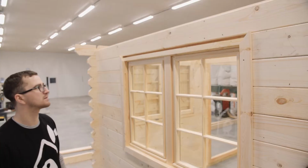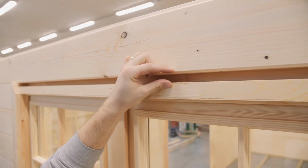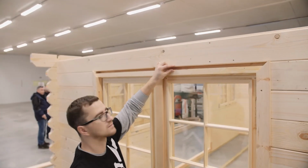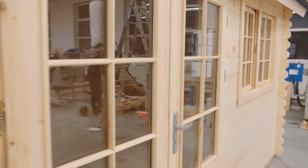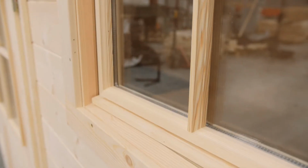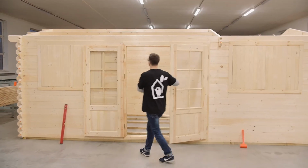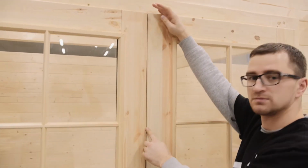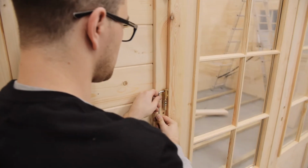The space between the door and upper wall board will disappear in a few weeks' time as the timber will naturally contract. This is applicable for all wooden garage doors, personal access doors, as well as windows. Sometimes you will have to rehinge the doors if they start to sag. Do this by adjusting the hinges correctly.